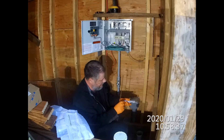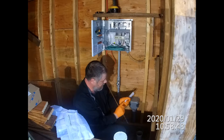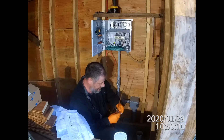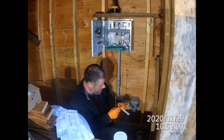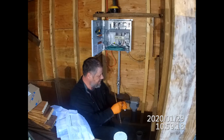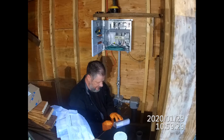If you heard that click, that's one of the pumps turning on — pump two has just started. Those who've followed my website will remember that it's the groundwater around the foundation that I'm collecting via the drain tile into the deep-well sump. That's then pumped into a cistern which feeds irrigation for my yard and two neighbors' yards, as well as the toilet circuit inside the house.